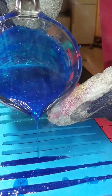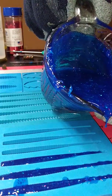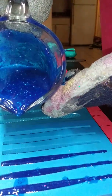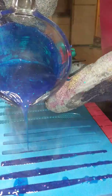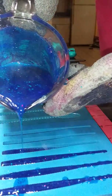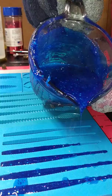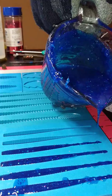Like I say, the front's filling up, back's filling up, flowing to the back, and then I just start working my way back a little bit. You get going good, you can actually keep the stream pretty much. When you feel that tail end back there, it'll be a stream rather than going dot, dot, dot. But that would be my suggestion to start off until you get the feel for it. And then you'll be able to get some really clean stuff. And these tails are probably the size of pencil lead.